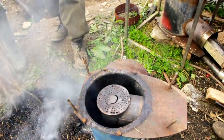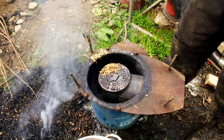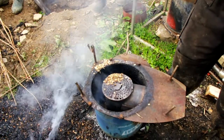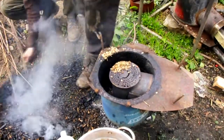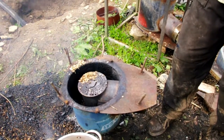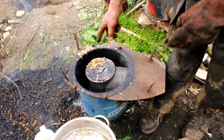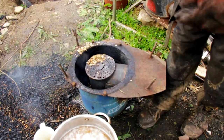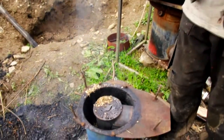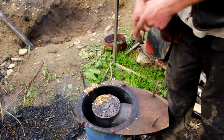The principle is: rocket stove, no insulation, you pack it full of wood chip and light it like a rocket stove. The wood chip wants to burst into flames but it can't because it's starved of oxygen. Combustion is burning in the presence of oxygen. Pyrolysis is a chemical reaction in the absence of oxygen or in oxygen-starved conditions. Pyrolysis happens in the outer chamber - the retort. Then you light the fire as a normal rocket stove in the combustion chamber. Pyrolysis - from the Greek: pyro meaning heat, lysis meaning loosening - it loosens all the gases from the wood chip and releases them.